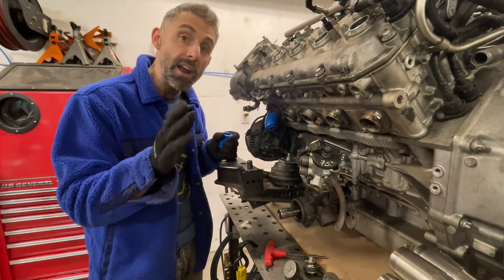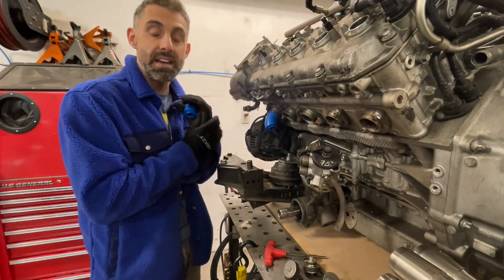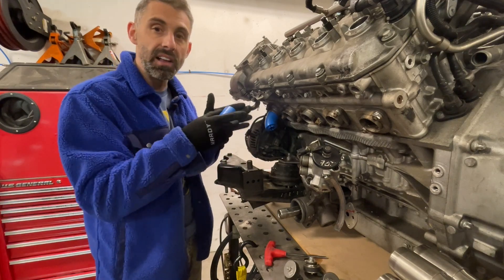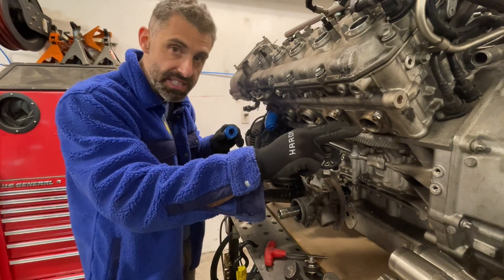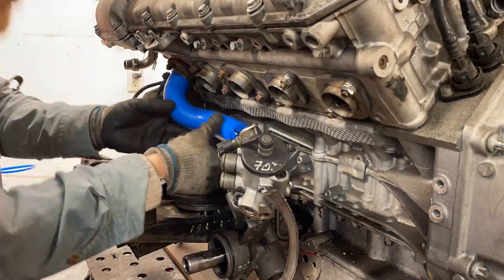This is so much better and cheaper than doing it out of steel because if you mess up or it's too short you lose that piece. This allows you to go through the entire setup methodically on all five cylinders to get to the collector before you have to cut any pieces of steel.